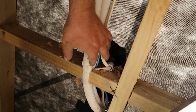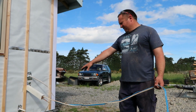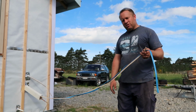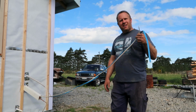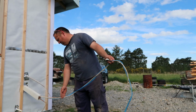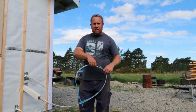Like that. Boom, done. We might even be able to get one more cable in there for a power socket. Because quite often you come back and you'll find they've put something there like a drain that you didn't see there before. You have to move it over a little bit. So I know it's not going to happen with this one, but it's just force of habit. So if I have to move it that way or that way down the house, I've got a bit of excess, so I don't have to stick joiners in. All I have to do is add a bit of extra pipe. Normally the pipe comes out to about here, where I want it to finish, and normally I'd take all this to the pipe, which I will still attempt to do.